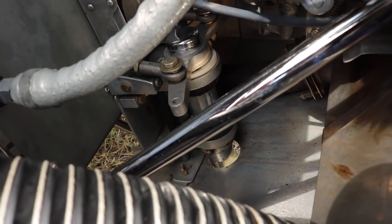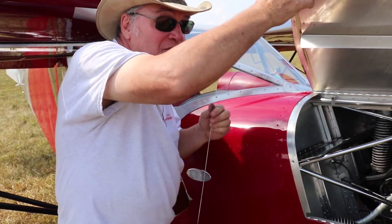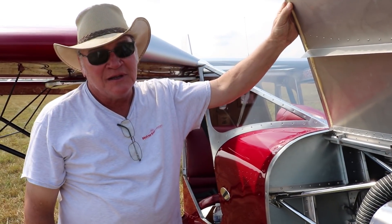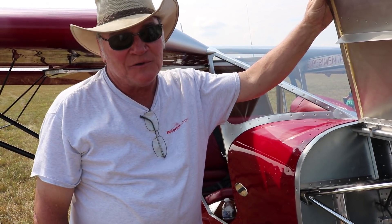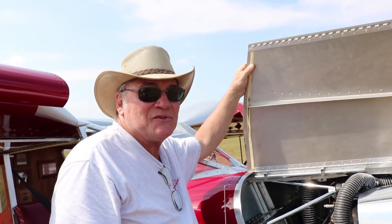While you're in the engine compartment, notice that you don't see a lot of wires tie-wrapped together, hoses. I tried to go with a very monochromatic look — it's all for looks. It's a 3.3 liter Jabiru 3300, 120 horsepower rated at 3,300 RPMs. It's a direct drive engine. It has a single carburetor. It's very, very simple. And I've been very, very impressed with the performance and reliability of them for many years — probably about 12, 13 years since I flew my first Jabiru.